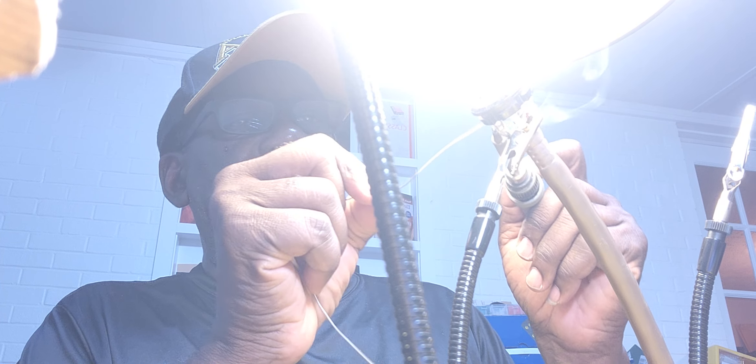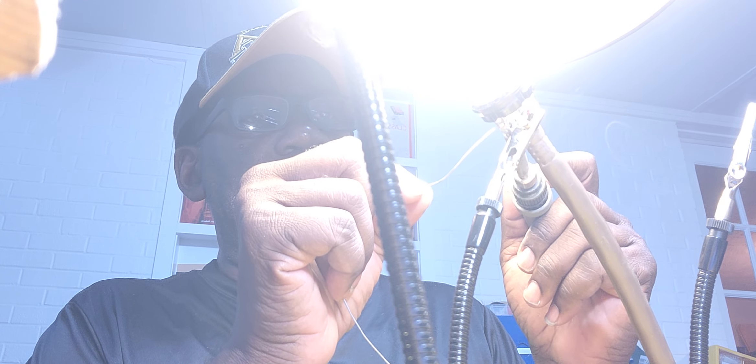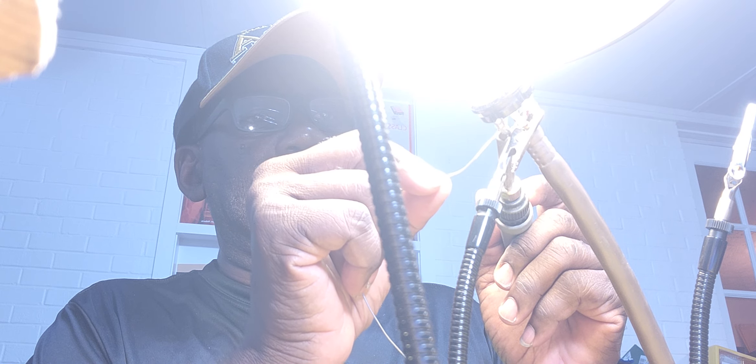I'm beginning with the brown wire. All I'm doing is just going to reinforce — re-heat it and add a little solder to each point. That's three of them right there: red, brown, and blue. Now I get black, yellow, and gray the same way.